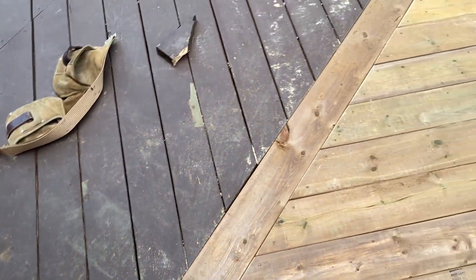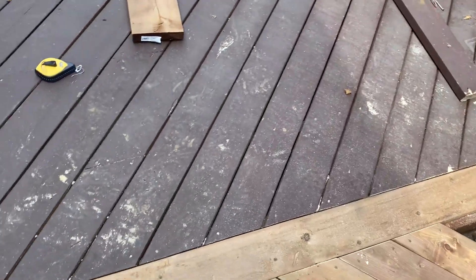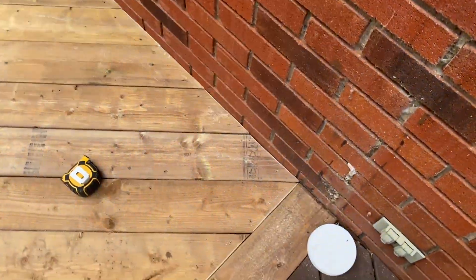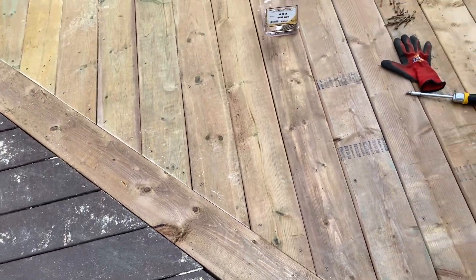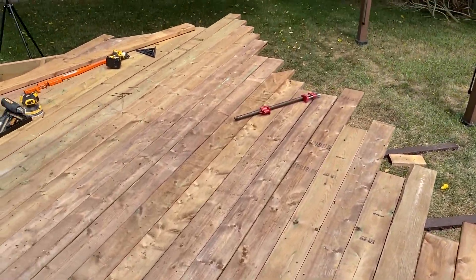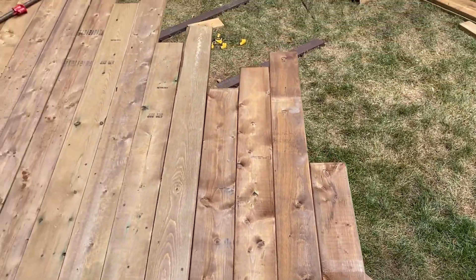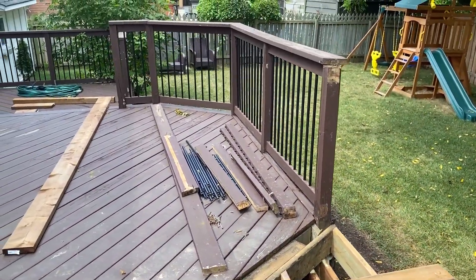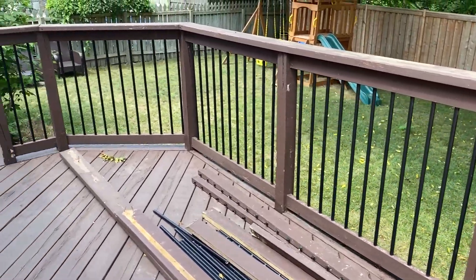The line out here is turning out pretty well — just about done, got a few more boards to do. The line against the house looks pretty nice as well. I like just taking the sander to it and buffing up the edges — gets rid of that sharp 90 degree and leaves a cleaner look. I don't like working with two-by-six, that's for sure. I'm really not sure I want to cut this back because I think I want to allow for an aluminum railing — once they see this they may want to switch the railing up. There's not a lot of railing here to save, and I'm not sure if I can get those spindles that length anymore.